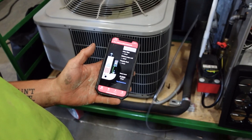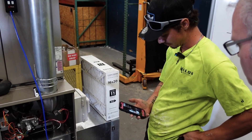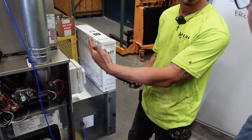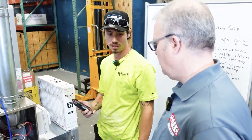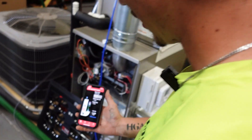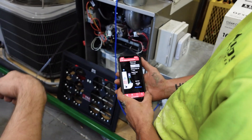Now we're going to start measuring pressures. We've got the manometer here with the static pressure tip on it. You look at the photo and put it where it says. It's measuring a pressure — you can go ahead and hit take a measurement. On this one I can just put one probe in, save the measurement, and move on — it's going to calculate the drop. Now for the blower side — actually, let me make a mistake on purpose here. That position is upstream of the filter, but in this case there's no ductwork upstream of the filter. Go back and change it to a filter grill.